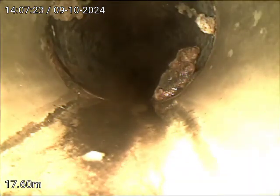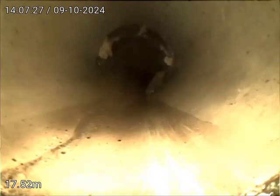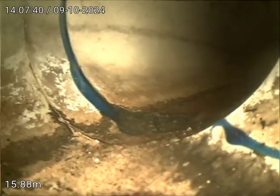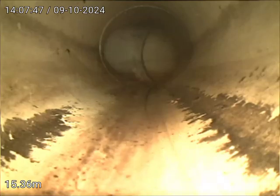I've located the PVC here on 647's property, 0.7 deep around here, just marked it in white. The downpipe will be coming in on the top of that IO there — change of direction. That's picking up the downpipe at the front door, so that's all PVC too.